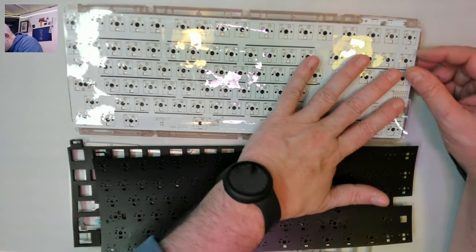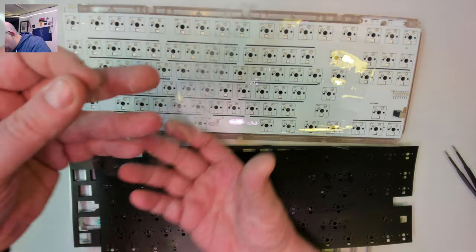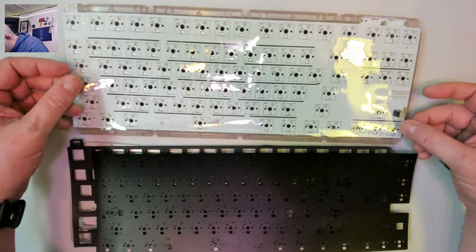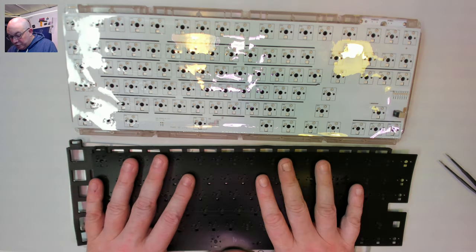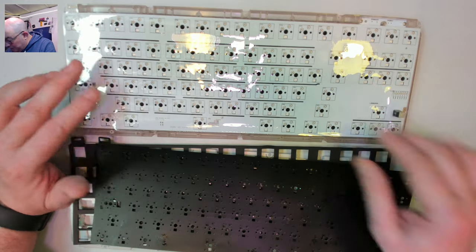There are some keyboards, I won't name them, that do not come punched out and can cause some issues when installing switches. What does the PET layer do? It adds some poppiness. It keeps some of the tones muted, but it helps other tones come to light. It works really well in combination with the IXPE foam.